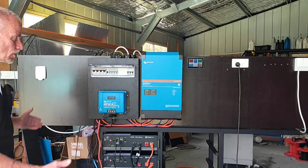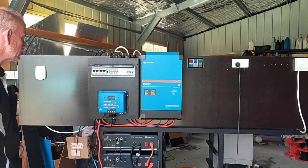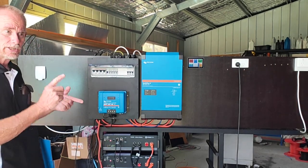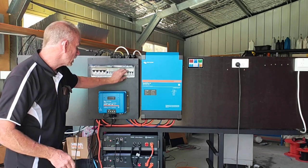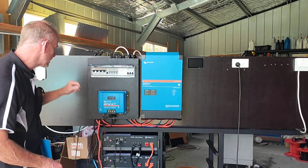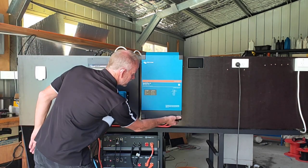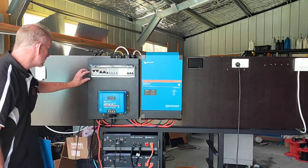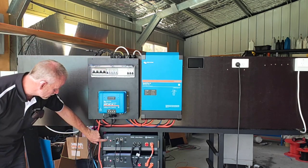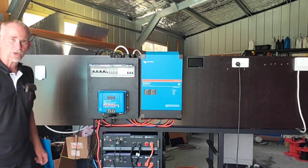I think we've covered everything. In a short space of time we've gone from no power to everything powered up, power points fitted and running, batteries up and going. Now the shutdown process: always turn off your loads and charges first — turn off the 240-volt loads, turn off the 48-to-12-volt converter to kill 12-volt loads, then turn off the solar panels, turn off the charge controller, switch off the inverter, and then turn off the battery breaker. The bus is now dead. Simply switch off the batteries; the system is now shut down and safe. Hope you enjoyed that, thanks for watching.